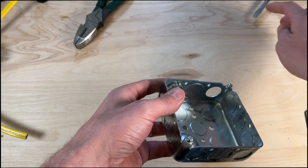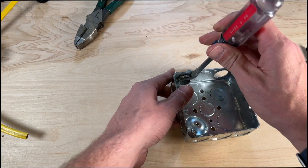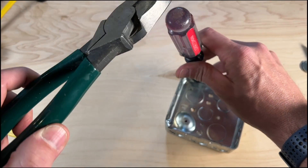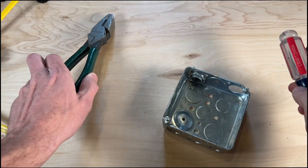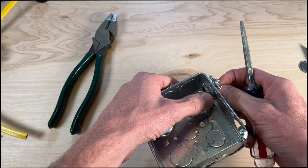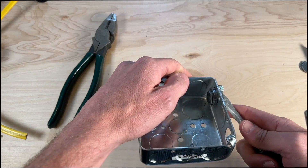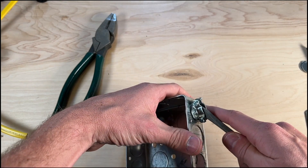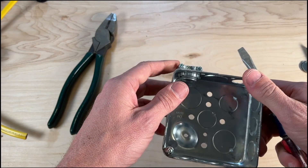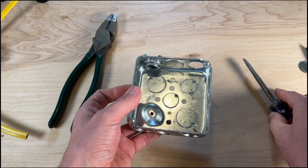Now with this nut you can take — this is an old beat-up slotted flathead — you can take that and tighten the nut. You'll see guys taking their linesmans and tapping that in to tighten it. If I have access to both sides like this, what I actually do is hand tighten to where I'm about 45 degrees off of where I want it, and then usually that nut will cinch on and I can just take my slotted and rotate that into place. So now I have it where I want it — I have access to the two screws I need to tighten to cinch down that clamp, and that's all you need to do.